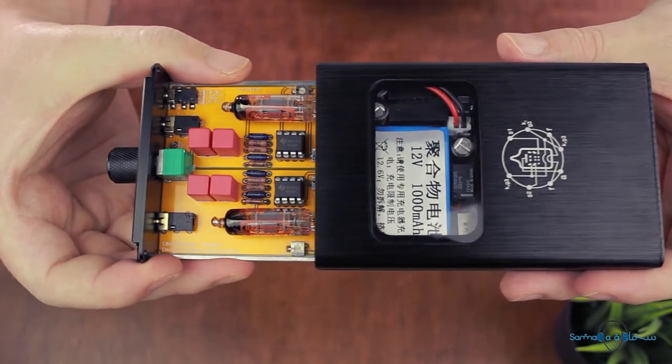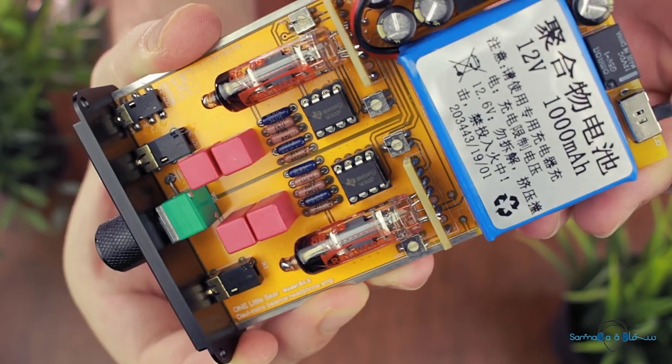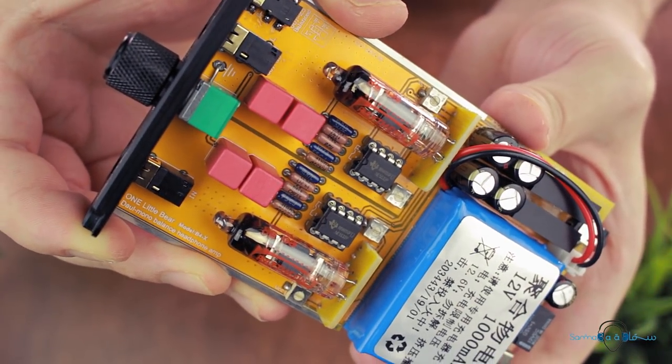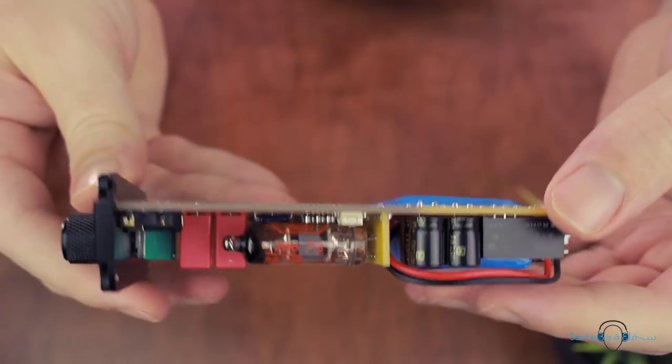In contrast, the B4X is more DIY friendly as the through-hole circuitry gives you complete access to remove various resistors and capacitors if you wish to do so — assuming that you know what you are doing and would replace those parts with only correct upgrades or suitable replacements. The two op-amp chips can also be swapped so you can pretty easily upgrade the sound quality. Unlike the previous Little Bear B4, the B4X requires two dual op-amp chips rather than just one, because of the newly designed circuit layout to incorporate the balanced output.